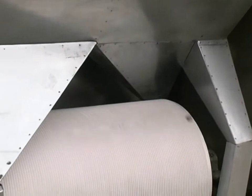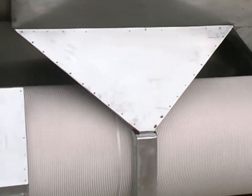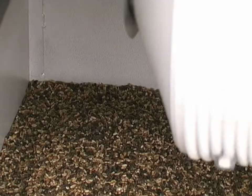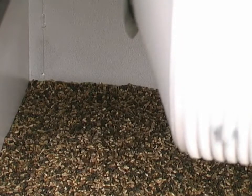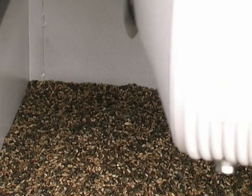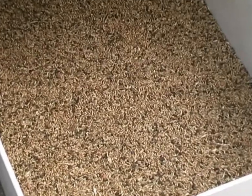The first indented cylinder separator separates out impurities which are shorter than wheat grains. This is important to achieve a high flour whiteness index. To prevent flour infestation, the indented cylinder separator also separates out crushed grain and weed seeds.